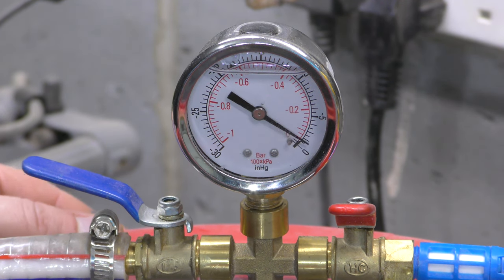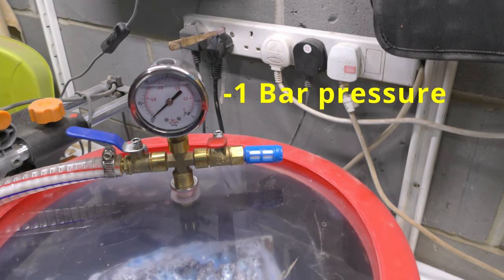Okay, here we go. So it started bubbling like crazy and that's what we want. It's white now. So now just stop it, close it and let it sit for a while. Then we release the vacuum — kill the vacuum — and hopefully the resin goes and displaces all the air that was in. That's the goal and the technique: we take off the air and put the resin in place of the air.